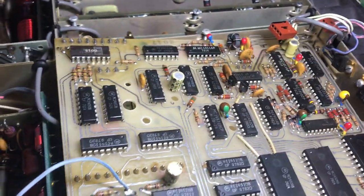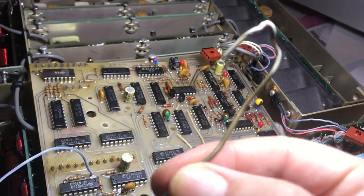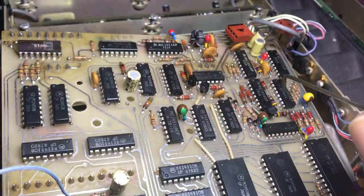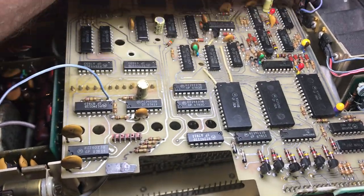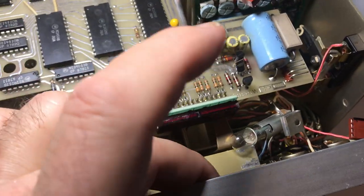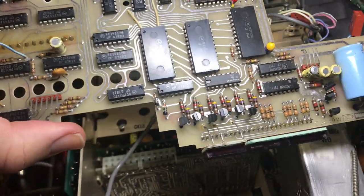Once all that is clear and free, and this wire is free, you want to get a coat hanger — which is what I used — and fold it up into a hook. I very carefully hooked it here and just pulled up on it until it sort of got loose. Pull up here a little bit, very gently. You keep pulling it up until it's loose. And even then it'll get tangled on a few things, so make sure that wire is out. Make sure it doesn't get tangled on things and it will eventually come out. You want to take the back out first — the front is tucked in here on the display board, into the display right here. You do not want to try to get the front out. You want to go from the back part and just lift the back out and lift out the board.